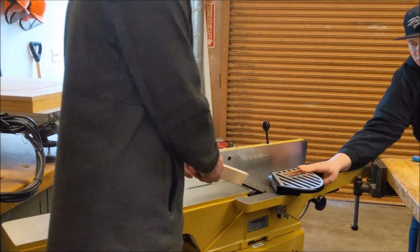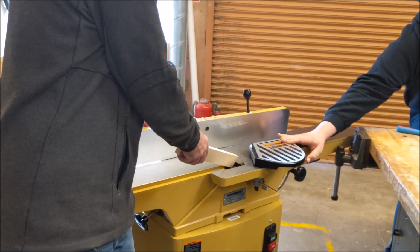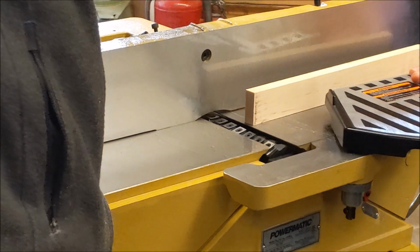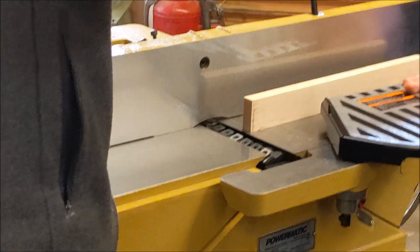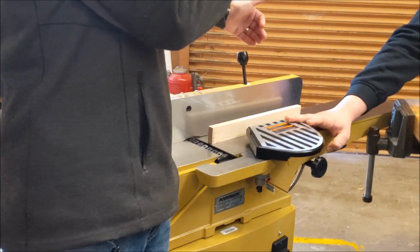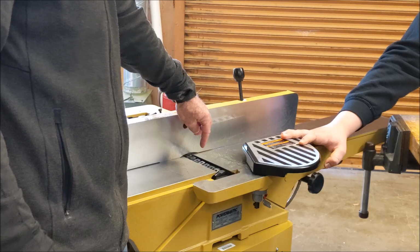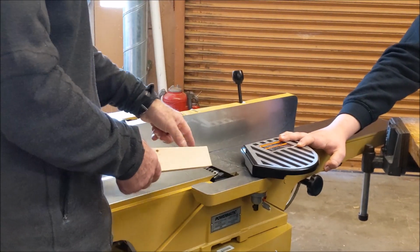That's the guard. This is a helical cutter head. On here, you can see that the knives engage the wood in a spiraling pattern. So now when you strike that wood, only a small part of the knife is engaging that wood at any given time, and then it works its way through the wood. One of the other really beautiful features on the helical cutter is a varied height as well. So you're getting a spiral pattern on height as well for engagement.